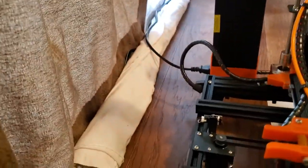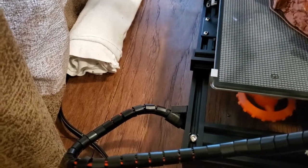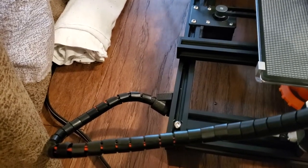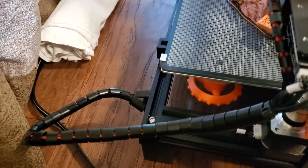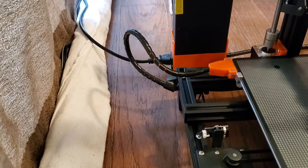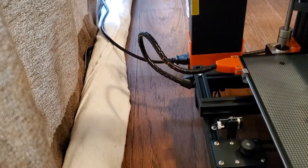Let's move to the back of the printer. This is on the floor because it's really stable and really level, so I like it there. You can see the cable guide right there. This is also available off that same spreadsheet from the Aerie1 Facebook group. It keeps your primary cable — from the controller of the printer to the extruder — in a way that it never gets in the way of the bed. It also keeps it from being jerked around as the print continues to go higher on the z-axis. On the other side, I printed another one of those cable guides and put it on the y-axis cable, on the heater control cable. That was a really nice upgrade — it's functional, keeps the cables in a good place, and out of the way of the printing mechanism.